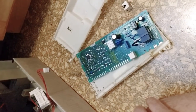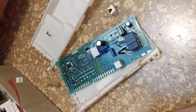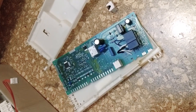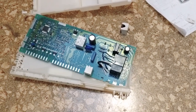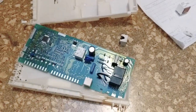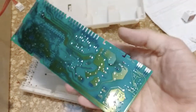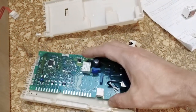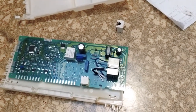If you are competent to do these things, I would recommend taking the board out and seeing if the relay is toasted — unplugging the dishwasher first, of course. I did some research and this is a notorious problem with Bosch dishwashers — it's been several decades that it's been a problem. The previous generation dishwashers, the problem was the trace on the PCB was too small and overheated from the current, and the relays would desolder themselves. It looks like they've beefed up the traces — there are these big ones here — but they did not put in beefy enough relays. A 10-amp relay running a 10-amp inductive circuit is almost certain to fail eventually.